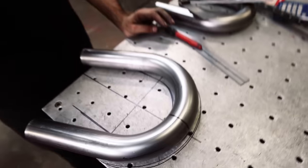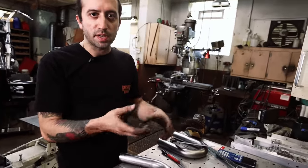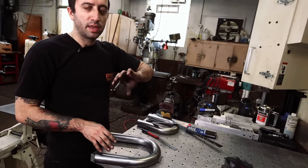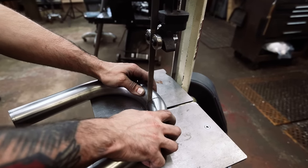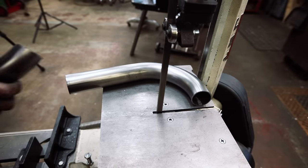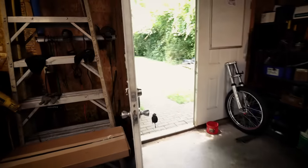This is going to keep your pipe rotating nice. If you cut it like this, you can twist these pipes any way you want them to go, and if you polish the pipe out it'll look like it was a bent piece. So now we're going to cut this.